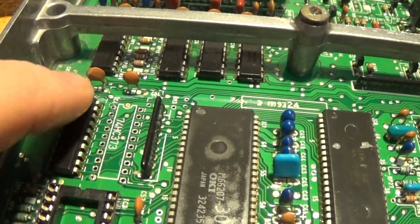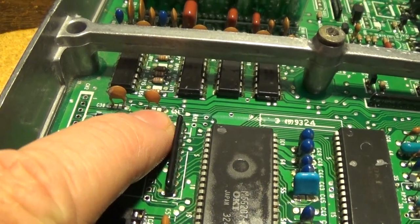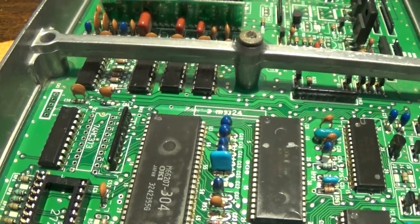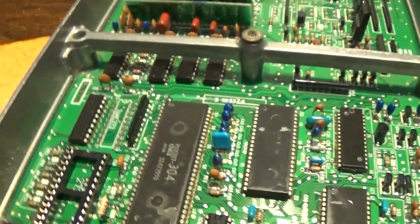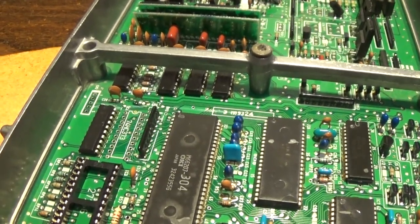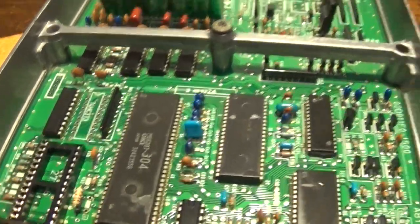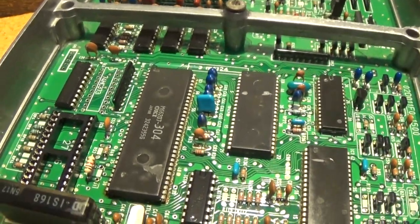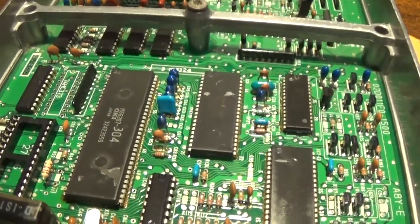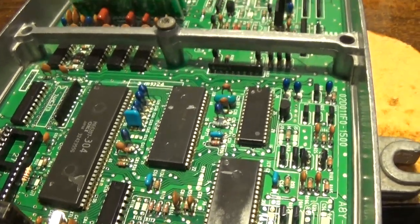The real true trick is when you flip it over — like this one here I did came out really nice on this side. If you look at the base of it, it's got a little rosin on it but it flowed all the way up to this side. When you apply solder to the other side, it should actually wick up a little bit into the component on this side — that's how you know you've got a good solder joint. What I see a lot of people doing online is they throw solder on the tip of the iron and then put that blob onto the component, which is tempting and kind of works, but it doesn't give you that nice wicking.